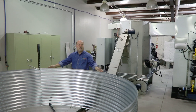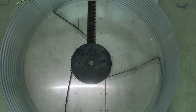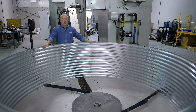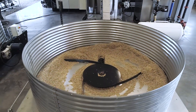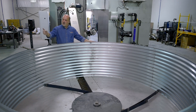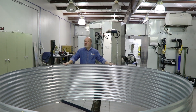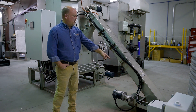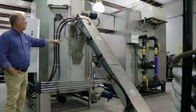The fuel bin here is a six-yard bin. It has an agitation system in the bottom that will drive the material into a horizontal auger and then up into the machine. It can handle a wide range of fuels — sawdust and chips, a combination thereof, or pellets. There's a sensor bracket we're getting ready to mount that will tell you if your fuel system is empty and shut down the machine and/or turn on automatic heat. We have the output of the feed bin system — a horizontal auger into an incline auger where it drops the biomass into the firebox.